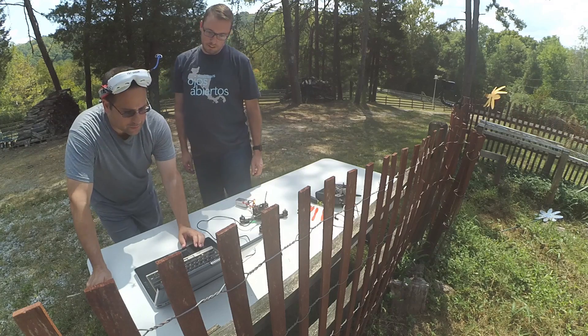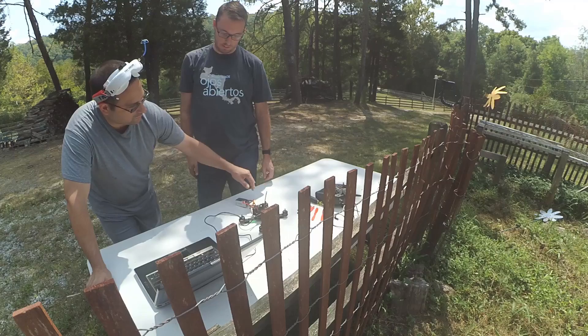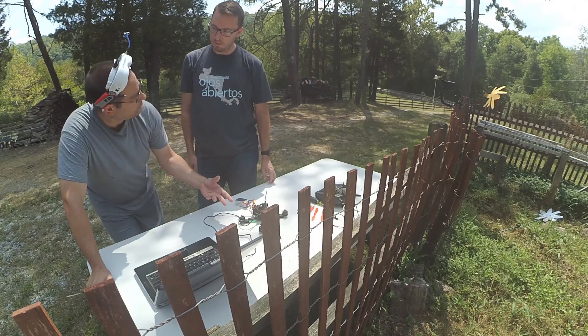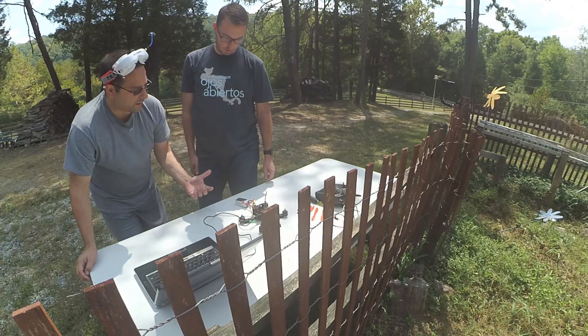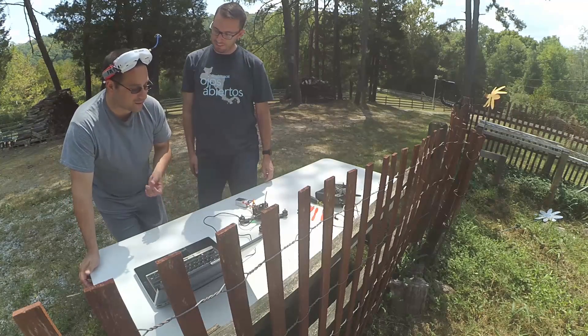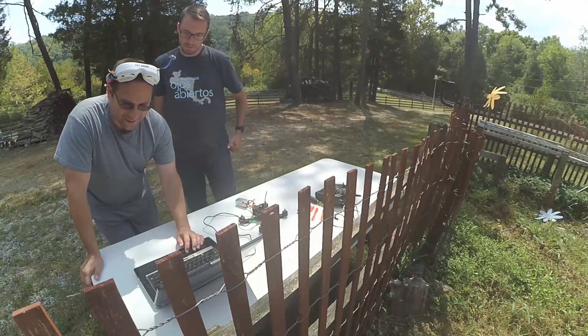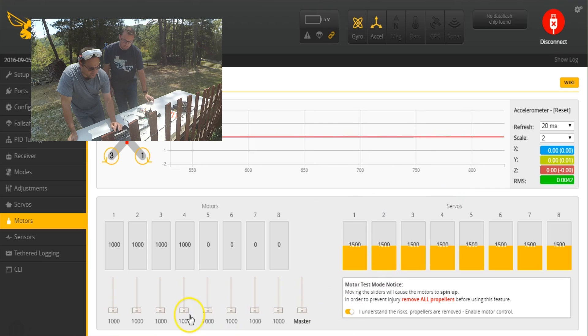With the smoke stopper they won't spin very fast, but it'll still give you a start when they start going thunk thunk thunk. If anything's in the way they'll hit it and they'll stop, because as soon as current rises the voltage drops through the smoke stopper. But it'll still give you a start and knock stuff over on your desk, as one of my videos famously showed. So to do this, I'm going to reset the accelerometer — they're all going to zero out. And then I'm going to spin one motor at a time and look at the results.